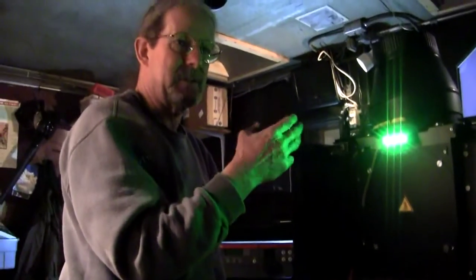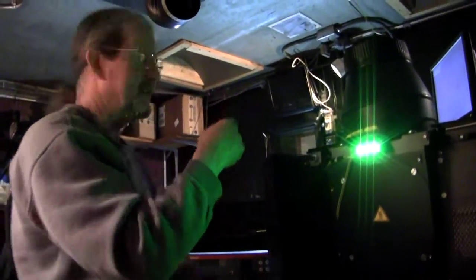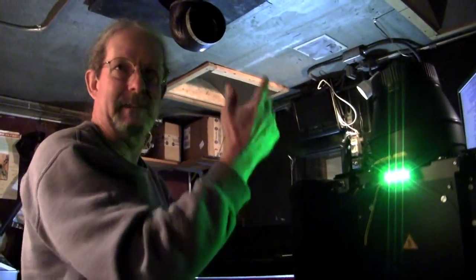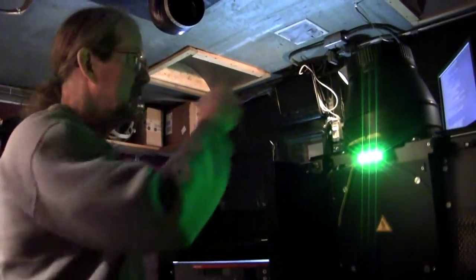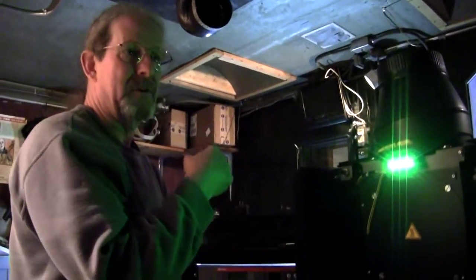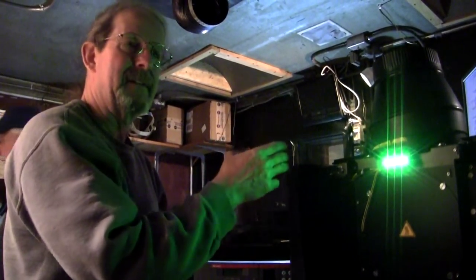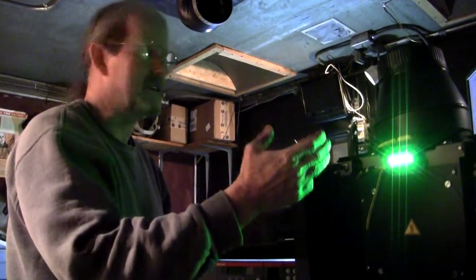It's a bunch of little switches. Most of the devices in the theater are controlled by close contact, just like pushing a button. We're going to have a dimmer up here with lights mid, lights down, lights up — each one of these relays assigned in the program to perform those functions. They become cues that you drag and drop into the timeline of the show.